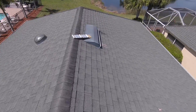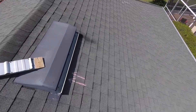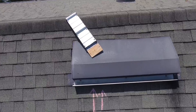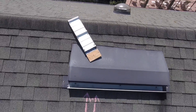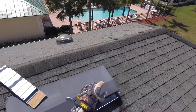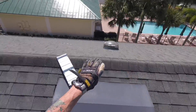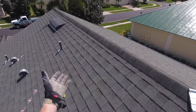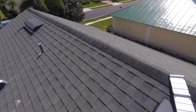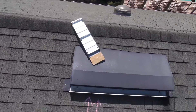The first thing we're going to do is get rid of these off-ridge boxes. These guys are like four-foot open windows into your attic, so they absolutely have to come off. In their place, we're going to replace the plywood and then install the top ridge-mounted vent system, which is going to allow a lot more air to circulate out and it's not going to allow water to get into your attic.